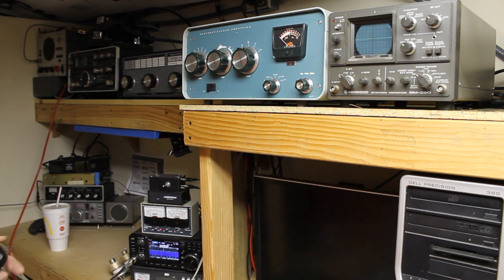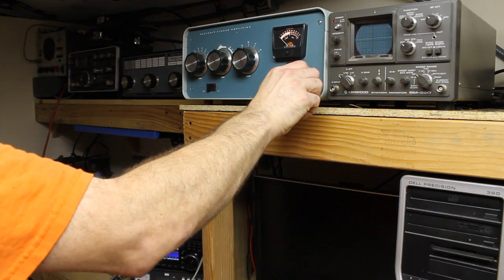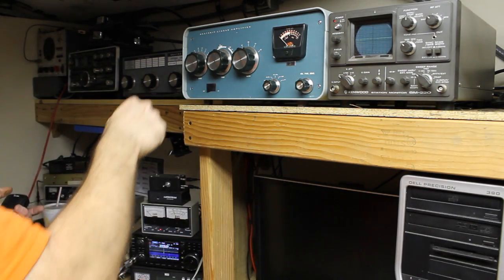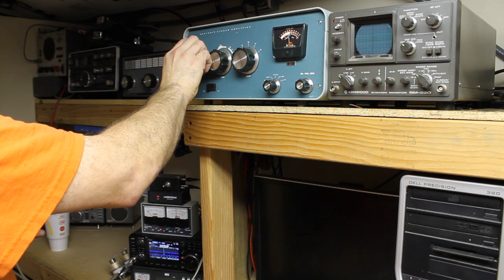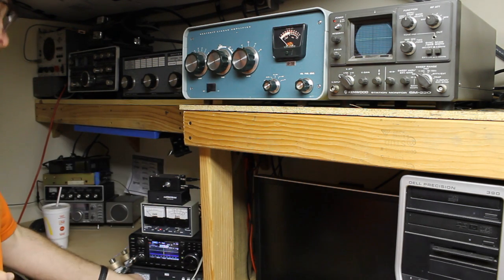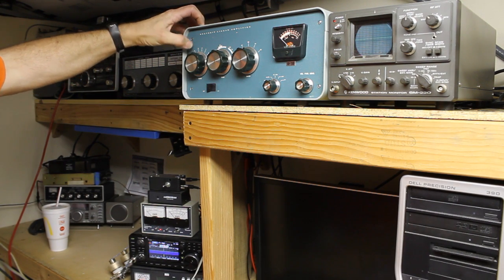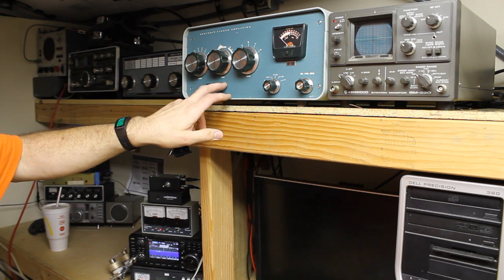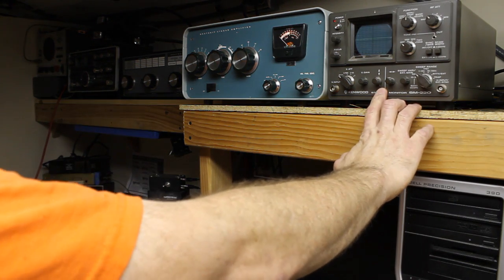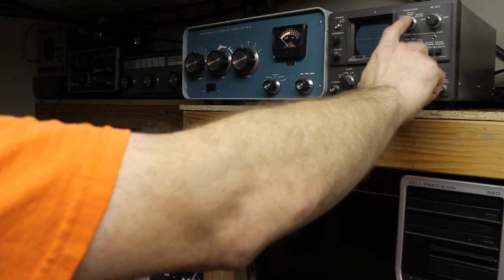I find that on my setup I get best power out between 68 and 70 percent. We're set for 2000 watts on the WM1. We'll key and turn our relative power sensitivity down. We're mid-range so we'll adjust again for best power out. Usually if your antenna is tuned correctly, the load control will be between three and five, and the tune control in whatever position corresponds to your band.